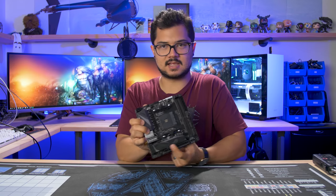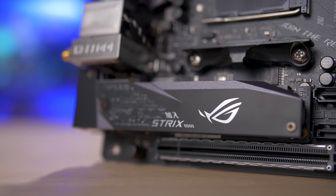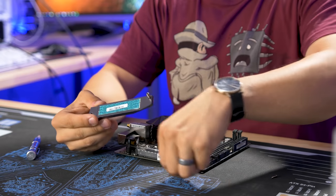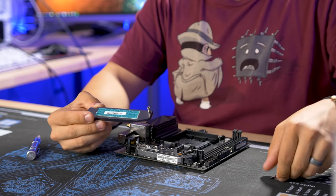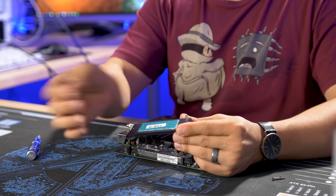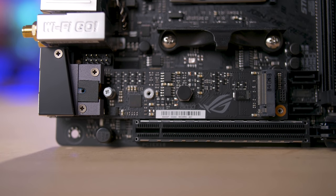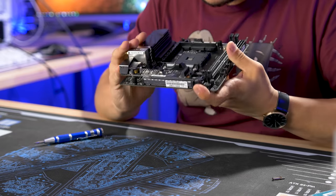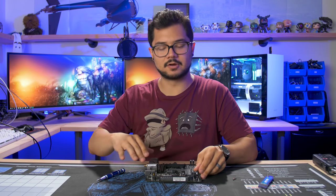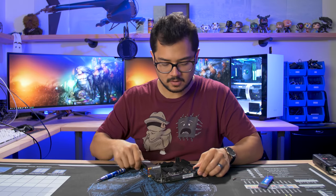At the very bottom, you've got your PCI Express Gen 3 x16 slot looking pretty with some metal reinforcement. And then there's this thing — what looks to be an M.2 shield or heat sink, which we should pop off and take a closer look at because this is quite interesting. Definitely a heat sink for your M.2 drive — NVMe supported, PCI Express Gen 3 x4 and all that. There's a thermal pad included with a little sticker you remove before applying it. The slot is raised up because underneath it is a heat sink for what I believe is the chipset — they've kind of stacked different componentry on top of each other to save space on this very space-constrained board, which I think is smart.